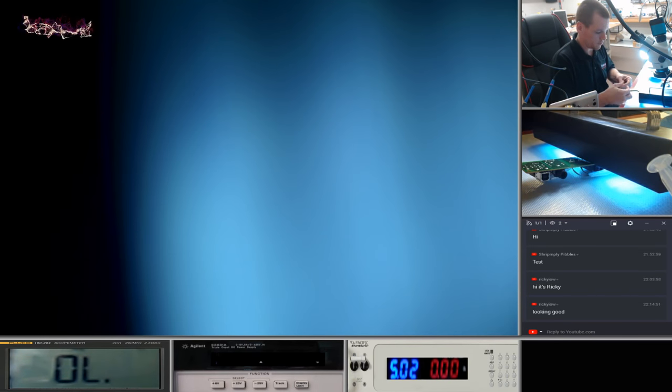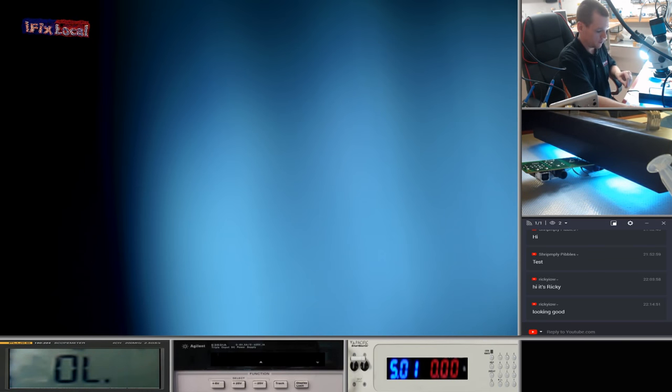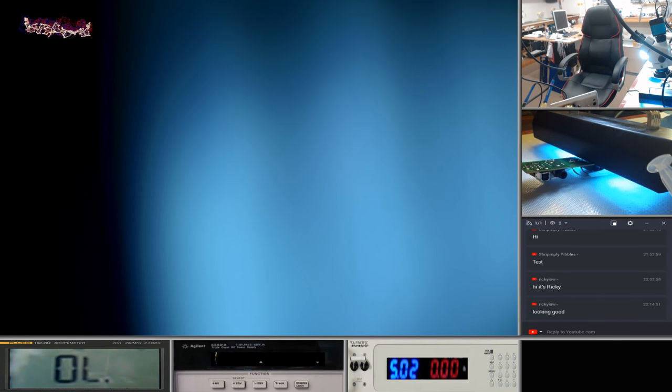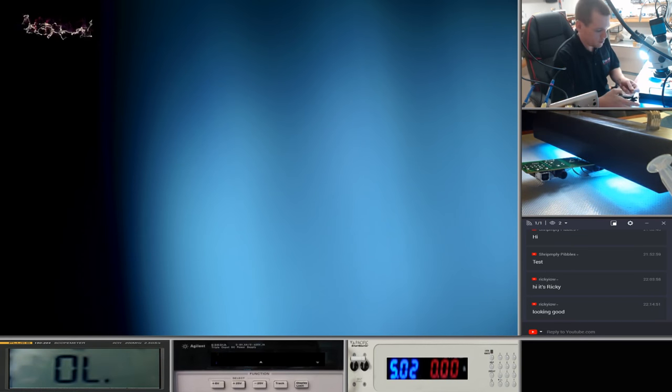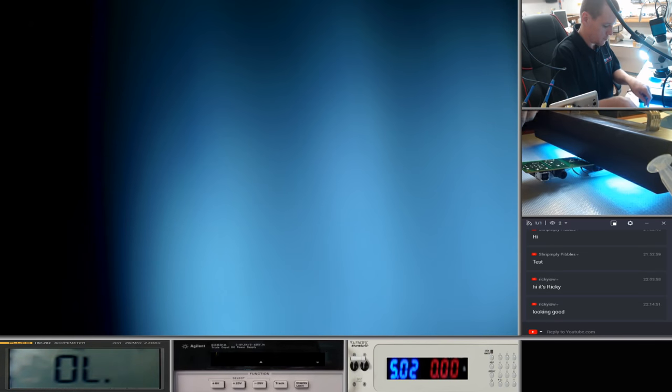Right. I think what we'll do is cut these down to shape, and as soon as that UV is good, I'm going to jump them, test the continuity, and then let the epoxy resin set overnight and probably call it for a night. Right, in fact, let's not use that. Where's my snips gone? I think the apprentices have my snips. Okie dokie. Right, there we go, that's one micro jumper. Well, not so micro, not compared to what I'm used to anyway.